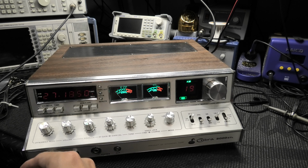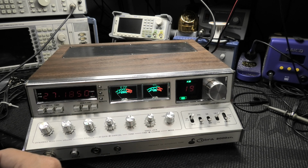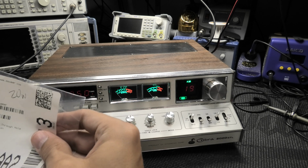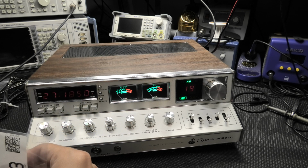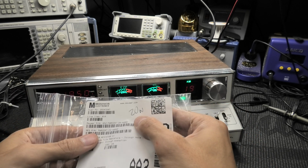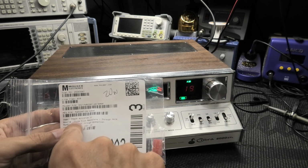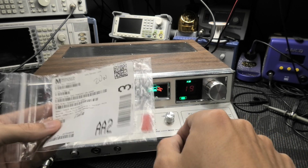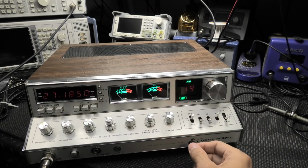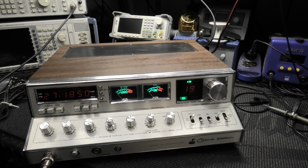It was actually by the same company that does the potentiometers for like the 10 turns and stuff like that. They do a bunch of stuff actually for electronics, but I've used, it's Bourns. I've used their potentiometers before, their pots. But yeah, this is what it is, guys. I wrote just on here for my own reference, 20 watter. It didn't say it on here. It's a 1% resistor, power resistor, thick film resistor. So pretty cool. Saves you hassle from doing a lot of other kind of rewiring and reconfiguring of different things and circuits and all that jazz.